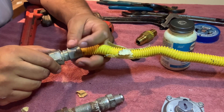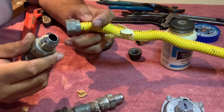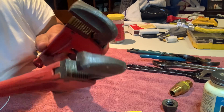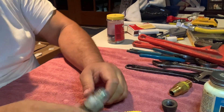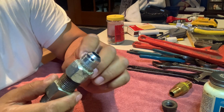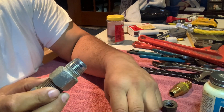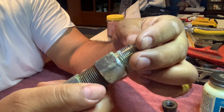I was hoping that would happen because here's another issue — this gas line is from a different stove. Whoever installed this on the gas stove, I also have a message for you. Now, what's the problem? Why did that happen? One of two things: rust — which is unbelievable that it would happen — but I did have this sitting in the garage for a while, so it could be rust. But I am noticing a little residual of maybe some pipe dope.